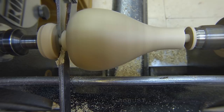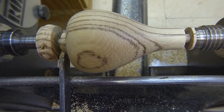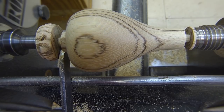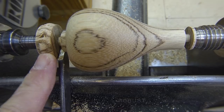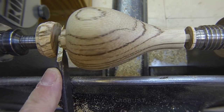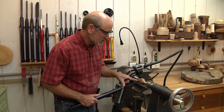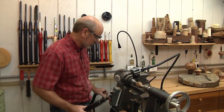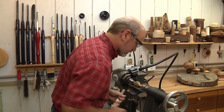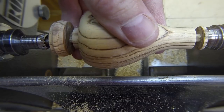Make sure on your calipers that you round over the tips so they don't catch on the wood. Now that happens — I haven't been able to show this in a long time. I'm going to turn this off. I didn't make a clearing cut, and you can see how the wood swelled up right there and grabbed that tool tip. Even though that was only a quarter inch deep, this wood must have had a little moisture in it, which caused that to happen. Now I'm a little bit out of round so we're going to have to readjust this on the lathe and fix this.